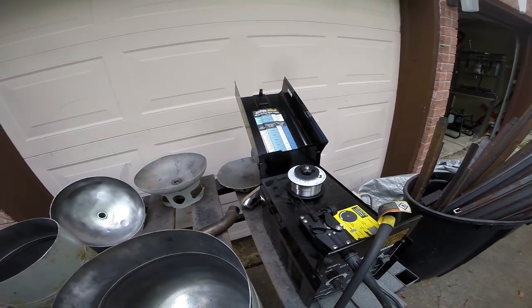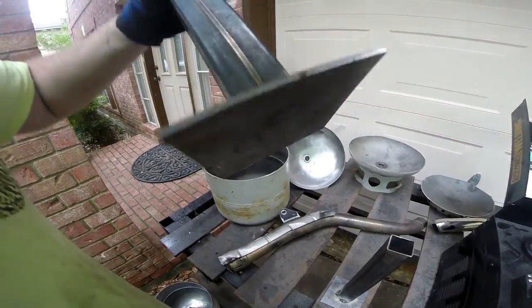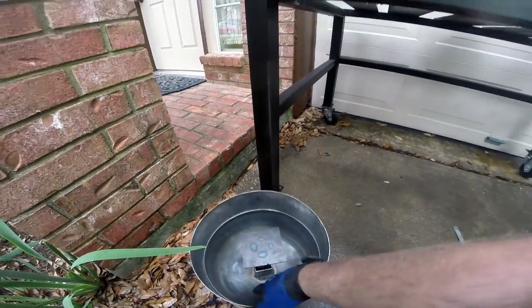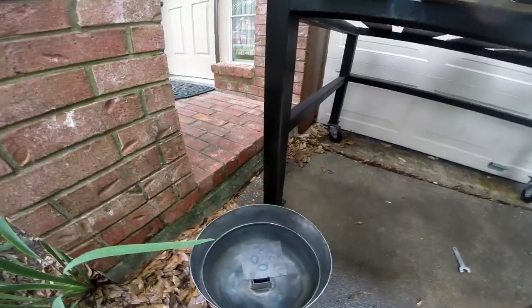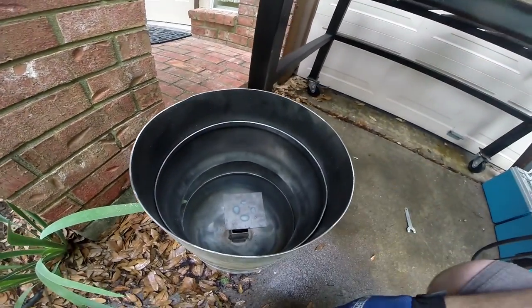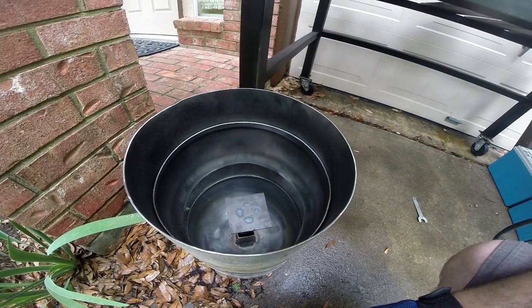The next thing we've got to do is put together our little pedestals and set them aside for later. Got it all nice and welded out — good penetration on the backside on both pieces because it's burnt through. So the pedestal will drop in like that, and remember this will be filled with cement up to a certain level, with lots of coals around, and then our crucible will sit right on top. We should have plenty of space for our crucible, which is going to be about six to six-and-a-half inches tall and pretty wide, and then we'll have a cover with a little air gap.